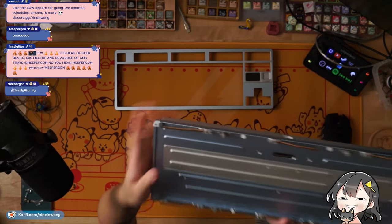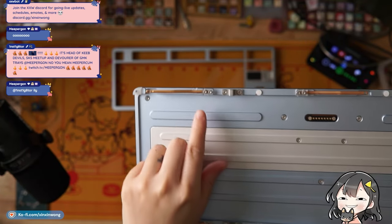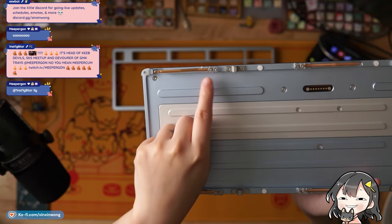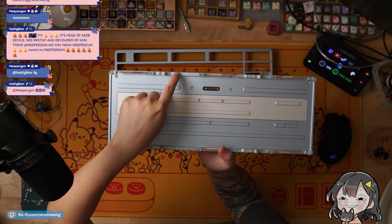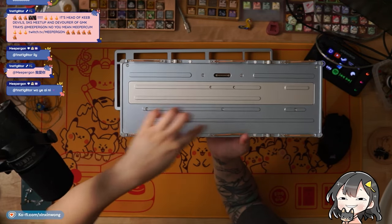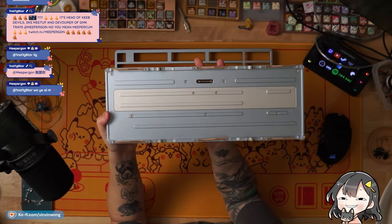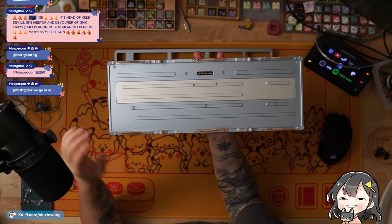And it's interesting, because check this out, there is a clear thing that they've used to screw onto it. Instead of using 1, they've used 2 screws. Both are used to screw this piece down, but also to help screw this clear little plastic piece down as well. And then they have these little silicone bumpers right here. This is adhesive, but I'm guessing this is for the ball catch, so their idea of a force break. So you have 1, 2, 3, 4, and then you have these side silicone pieces that have also been screwed down. So 1, 2, 3, 4, and this is to prevent the top piece from shaking. So not only have they implemented the metal to metal contact with the ball catch, but also the shifting of the ball catch as well. So you have 2 things implemented.